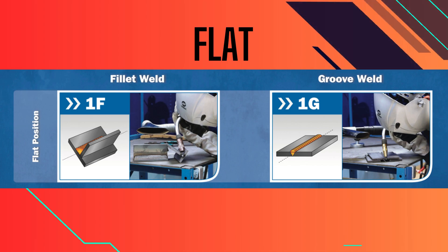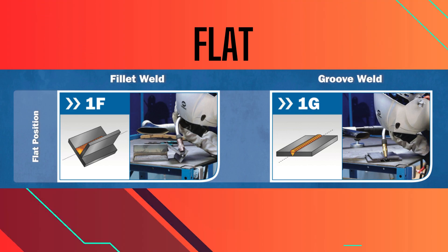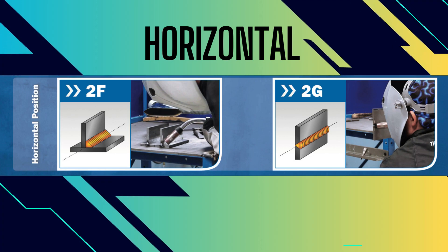The first position is the flat welding position. Generally, flat is an easier position to weld in since you're not fighting gravity. The weld molten metal stays fluid and wets into the joint evenly. As a result, operators can typically run hotter with higher deposition rates. In general, it is said that in the flat position, the weld is symmetrical to the true vertical axis.